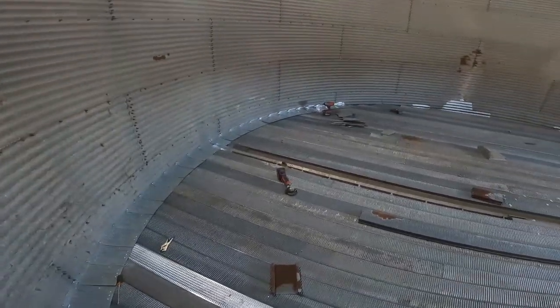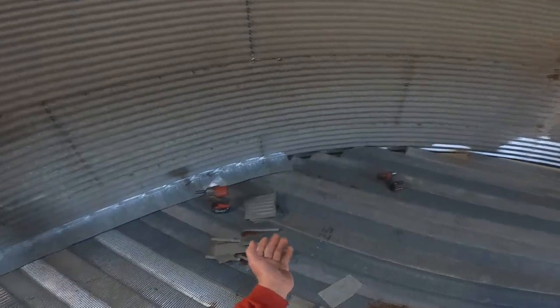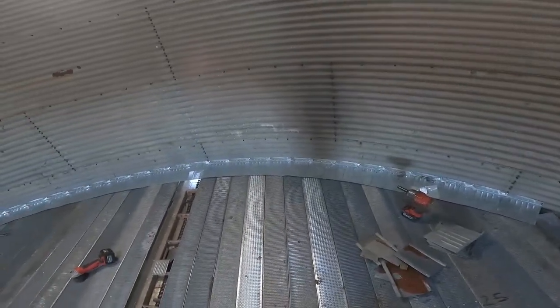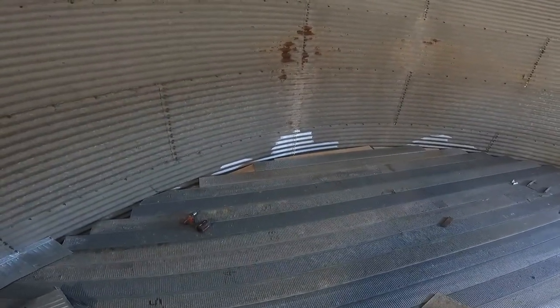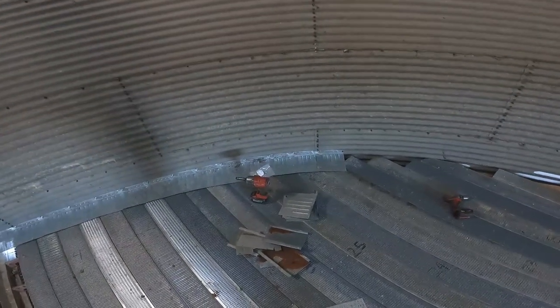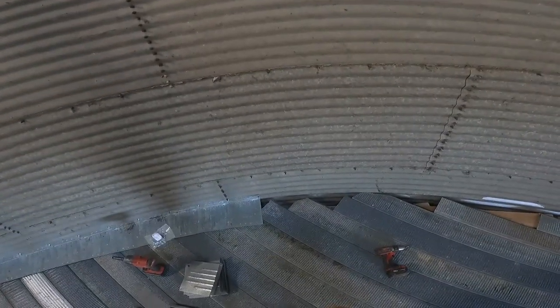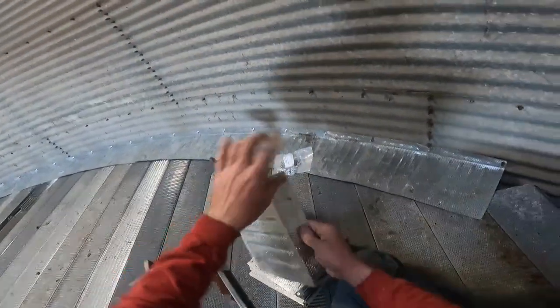I think Brennan is moving the cord outside, so we have this moment to take a break. I'm drilling holes from the inside, and I'm piloting them, and he's coming from the outside through my pilot hole. That way it's a little more interactive on his end. So it's just a counting game, and I think we have just enough flashing for two bins. Okay, sounds like he's got enough cord. So I already piloted it. He's drilling through.